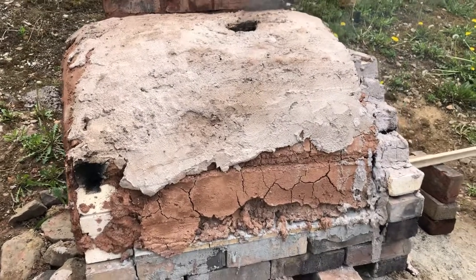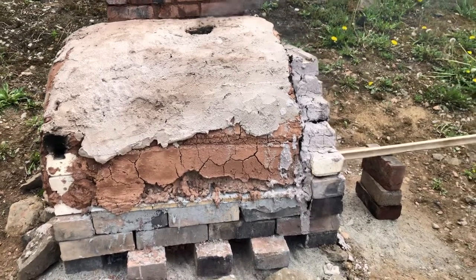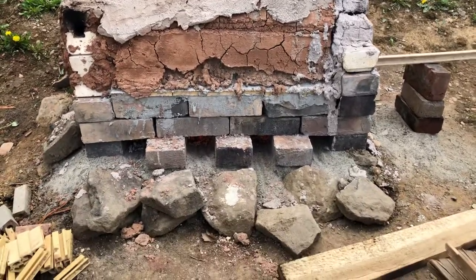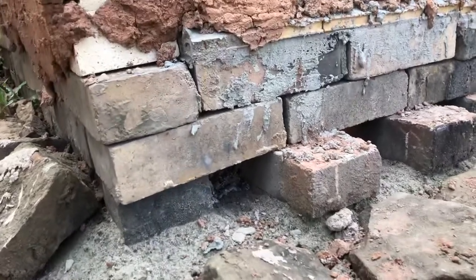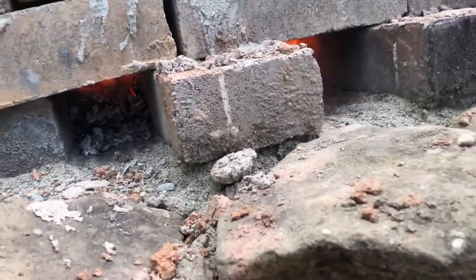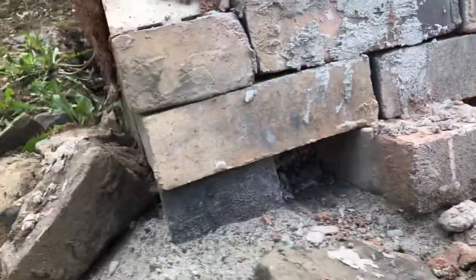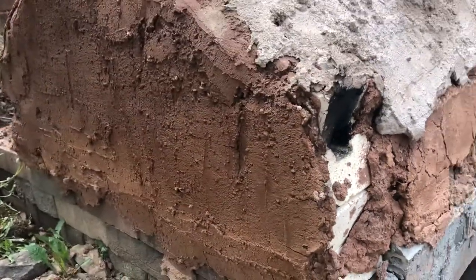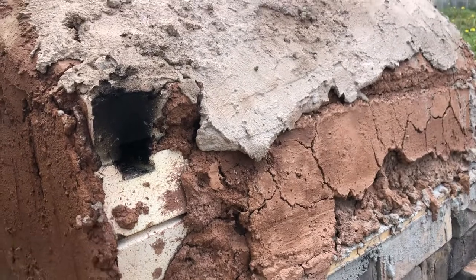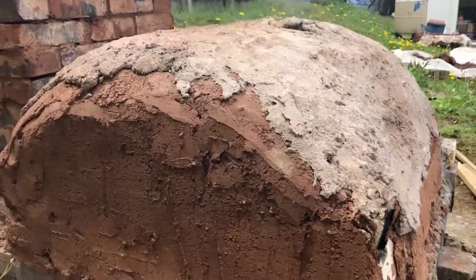You can see what it is — it's an old electric kiln that I had sitting around the shop. I cut it in half and turned it on its side, then stacked it up on some kiln bricks. So it's about three layers tall. This is the air intake and the flue. The sidewalls are actually made out of other parts of the electric kiln that I took apart. The arch itself is an old electric kiln turned on its side.